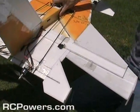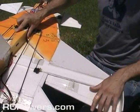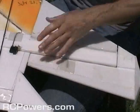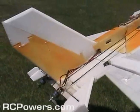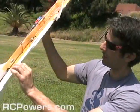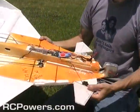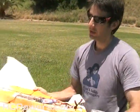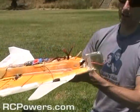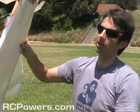What I've been basically coming down to — being forced to find the common denominator — is a few things. I need to have more control surface on the wingtip rather than on the inside. That's why the aileron looks backwards like this, where it's bigger out here and smaller in here. I need a vertical stabilizer system that gives stability at high alpha, because when you're pitched up like this you're not getting any air on your tail and it starts to go out. So I need other means of keeping stable vertically. The canards you've got to be careful with, because the bigger these are the more drag they cause. Which means you need a bigger stabilizer to counteract the drag. So I can't get too big on the canards, but I do need them for when I come up like this to keep my nose from stalling and to come back up.